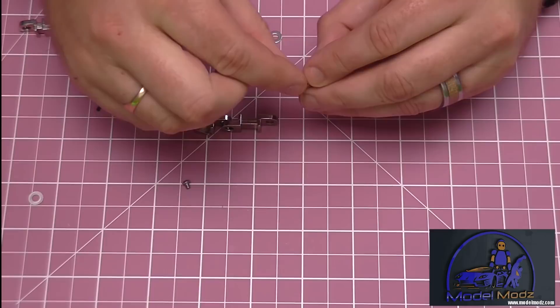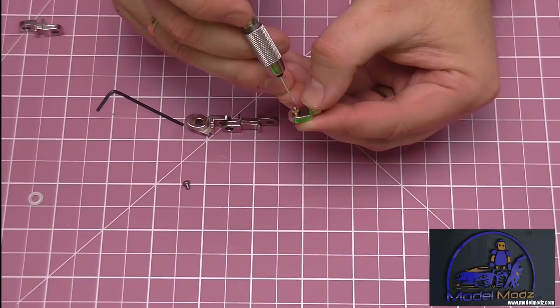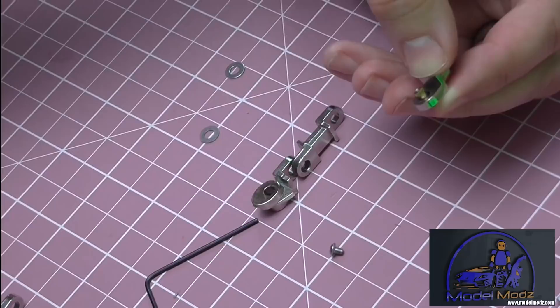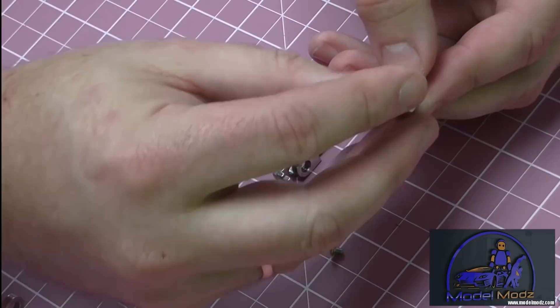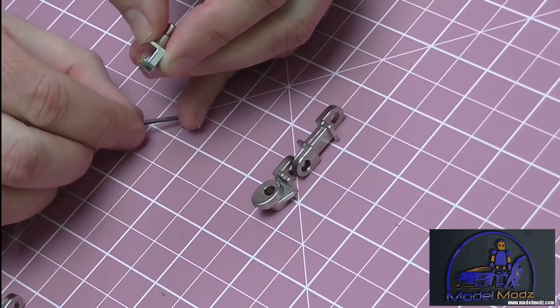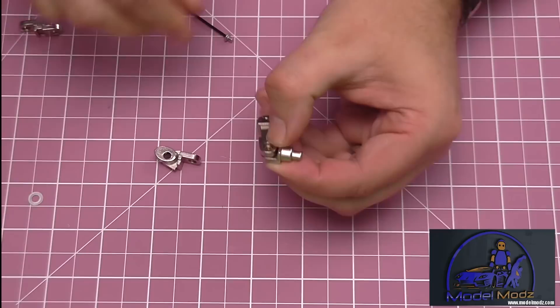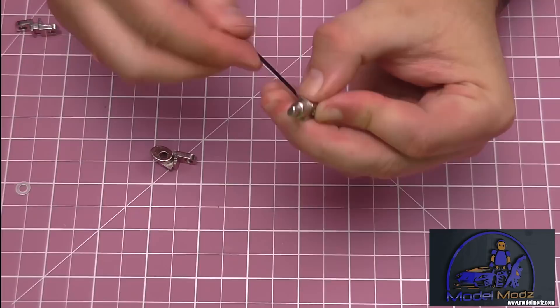That's dry now. I'm going to put it through the top and assemble it exactly the way I just showed, but before I put the washers over I'm going to drop some glue into this side of the housing. Then put the two washers over - one, two - then screw one of the allen key bolt screws into the other side. Once it's connected on top, I'll put it in at 90 degrees to start so it's easier to hold, then put the other screw in through the other side and tighten it up. There we go, that's in place.